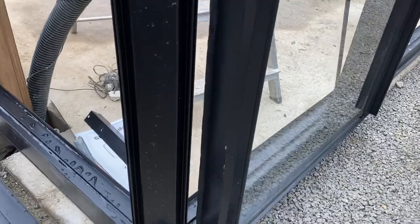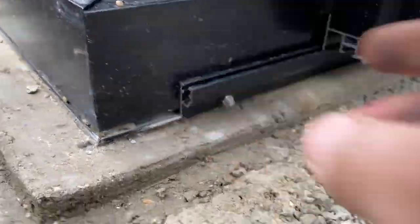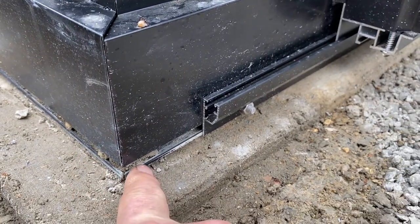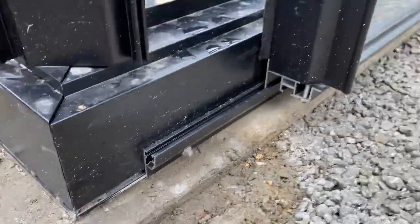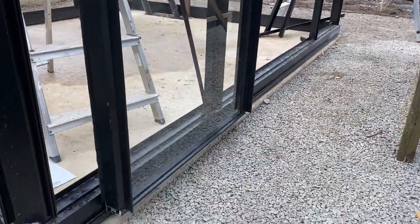The first place where you need to think ahead is the retaining groove for the bottom. This one is held by three screws, and the problem is that as soon as you've done this first assembly, that side traps it. So you need to work out where you want to put the sliding doors — one side or separate — and get the screws in first: three for each sliding door, so six in my case with two sliding doors together.